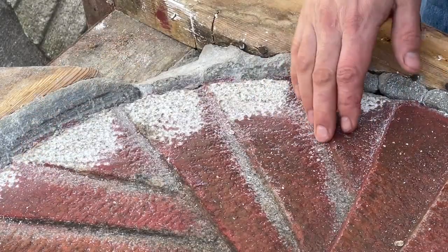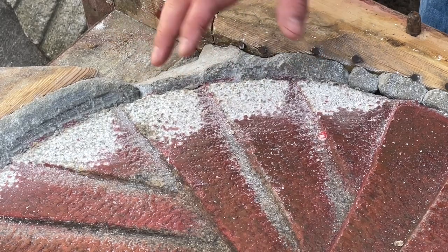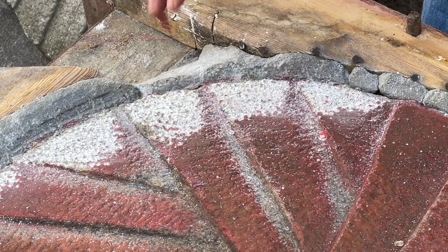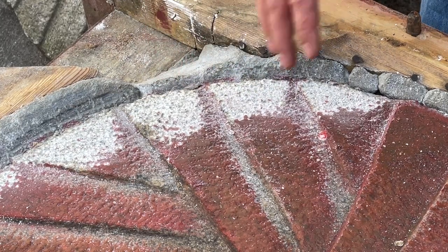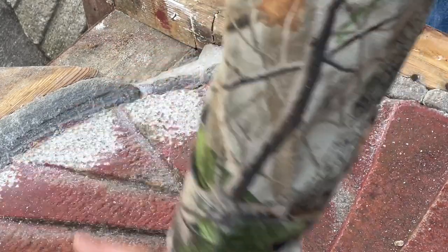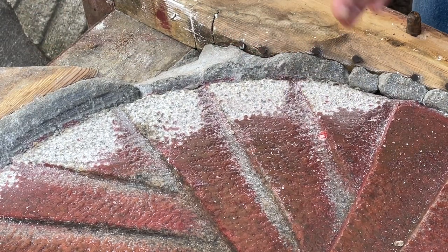Another thing about the first spot that shows up when you run the stones and let them touch: the first spot that shows up, you're going to have to take that spot down the farthest because it's the highest. You keep dressing and you just keep taking that same spot as well as everything else that shows up until you get the two faces exactly true to each other.